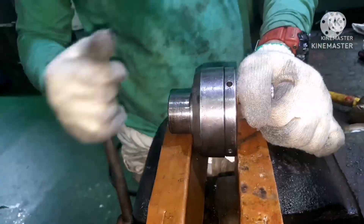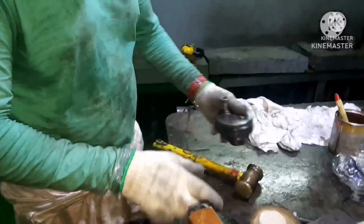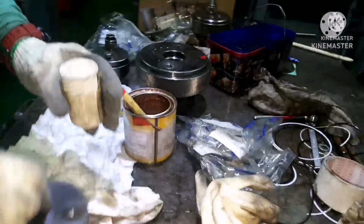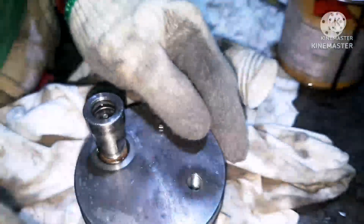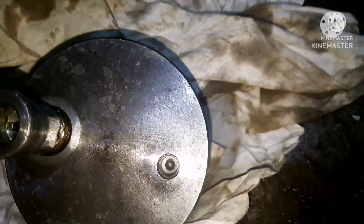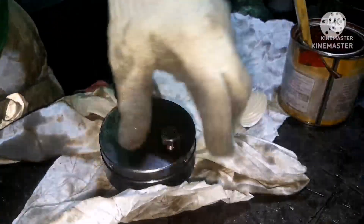Keep the jack on the vice and start tightening so that equal pressure is given and the cylinder gets fixed along with the piston. That's all — we have assembled the hydraulic jack. Next, fit the steel ball and set screw: first fix the steel ball, then fix and tighten the set screw. You can see the ball is seated in the groove. Tighten the set screw with the help of a spanner.